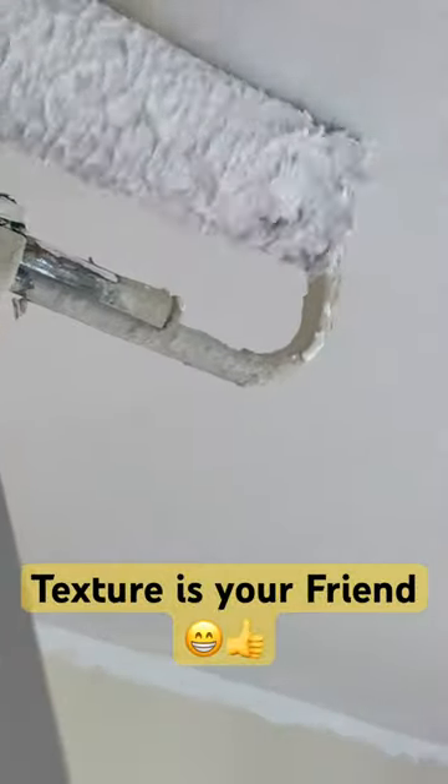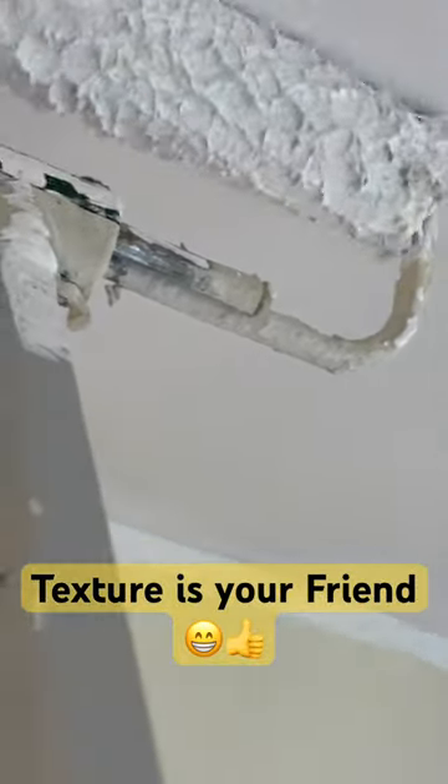The biggest thing with rolling is making sure to put the paint on heavy enough, overlap a couple inches, and don't overstretch the paint. Now I could go a little bit farther, but I'm going to backtrack, pull it back, and leave it that thick.